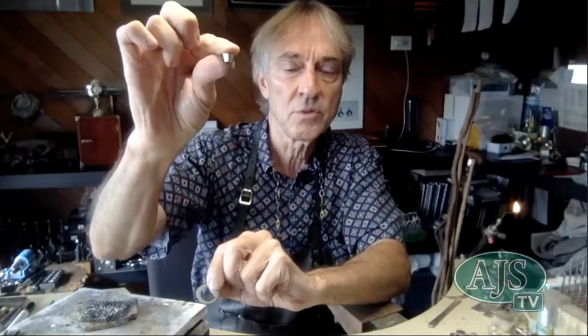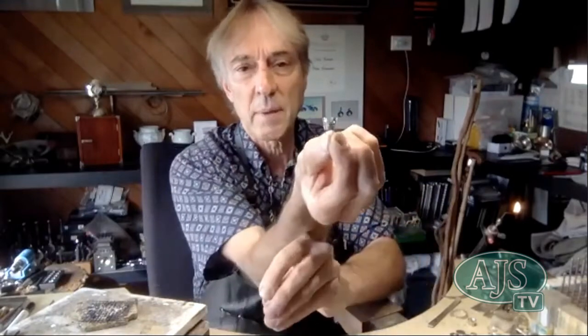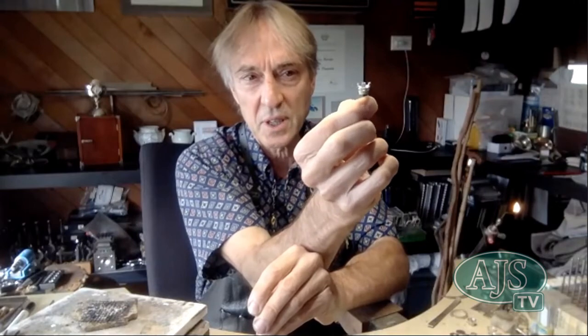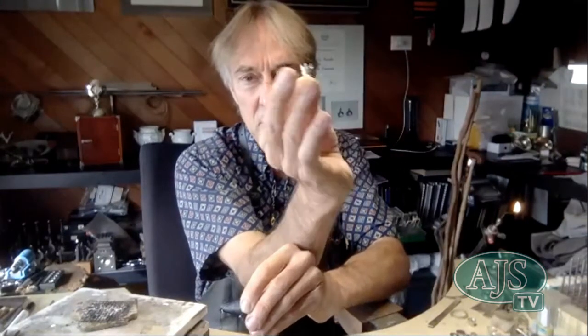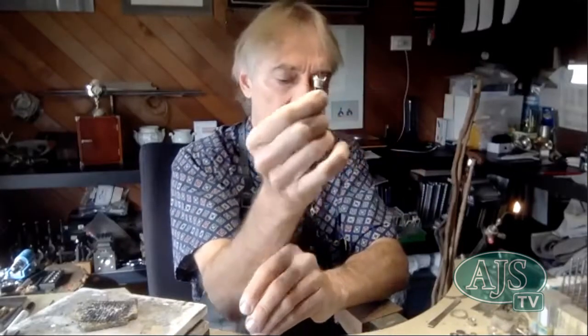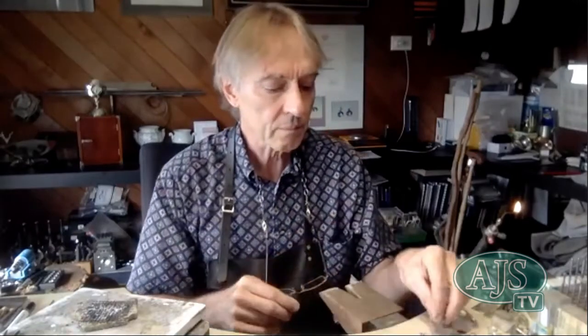Here's a little sample — a ring with a solid shoulder, a little thicker at the top. This is actually a hexagonal collet, six-sided, for a six-sided stone. I've made a cut on it to allow it to fit onto the ring shank so it sits solid. It's very plain on the side — flat little sides all tapering down, six sides, but no decorative detail. What we're going to do today is take our diamond stone and make a collet with saw piercing and claws on it.